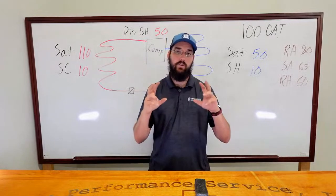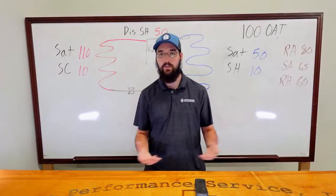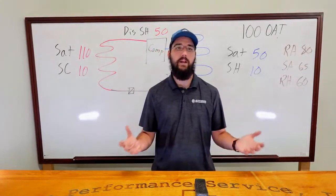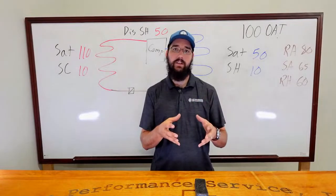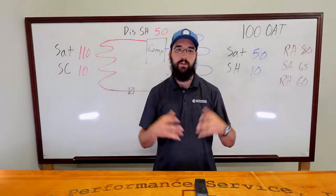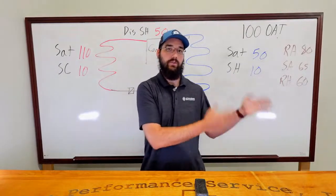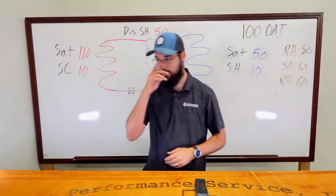So typically, your water source heat pumps are only a few tons at best, maybe 5-10 tons. I think they can get up to more than that in some large cases, but the vast majority of the time it may be 5 tons. In this particular case, these are large design systems where you can process an entire wing or an entire floor of the building, and we water cool the condenser and send it to a cooling tower instead of having remote condensers or such.